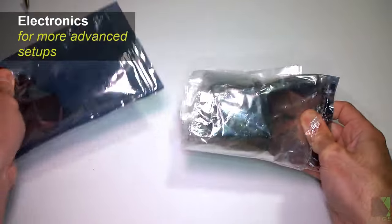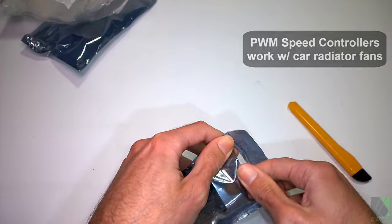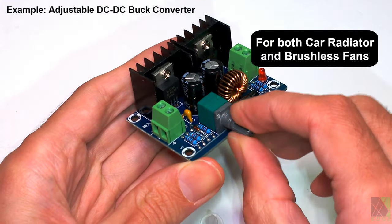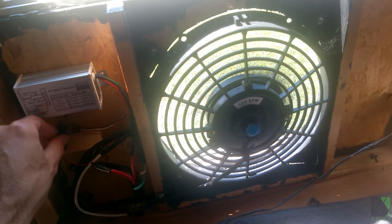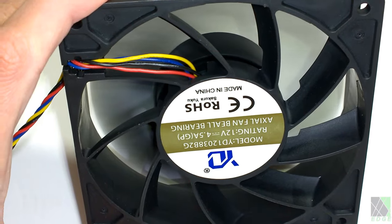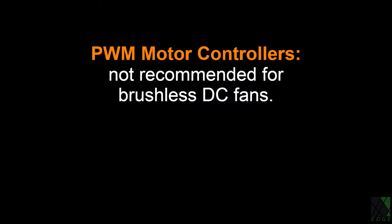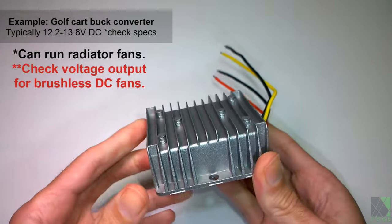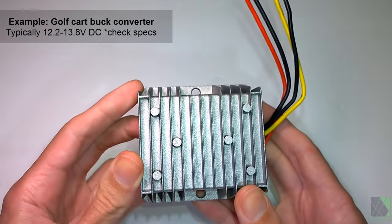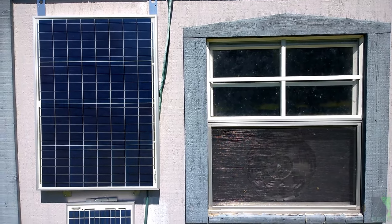One solution is to introduce some electronics. A basic PWM or pulse width modulation speed controller, or a DC-DC buck converter or regulator, can protect the fan from voltages that are too high, plus give you control over the fan speed. I have used both PWM speed controllers and DC-DC converters and both options work, either separately or together. It's great to have full control over the fan speed anyway. Basic 12 volt car radiator fans have no electronics inside, but 12 volt brushless DC fans do. For this reason it's important to supply them with a regulated voltage not to exceed 12 volts — exceeding the rated voltage on a brushless DC fan is very likely to burn it out. Here's an example of a golf cart DC converter: it simply takes a higher voltage from the solar panel, whatever that happens to be, and outputs no more than 12 volts DC. You can also run that regulated output into a PWM speed controller, which is what I did in one of my sheds. I can hook up any size solar panel and ensure no more than 12 volts DC reaches the fan.